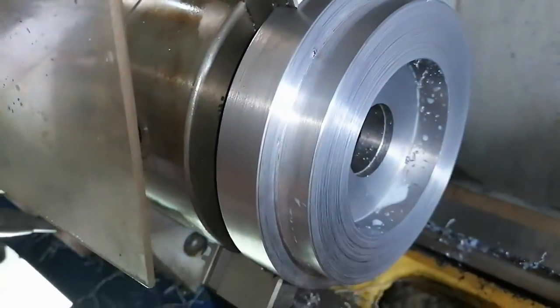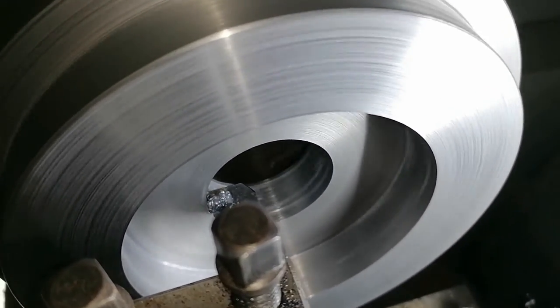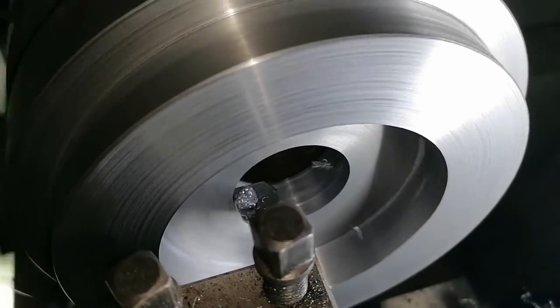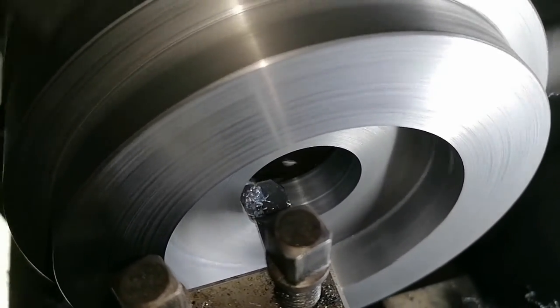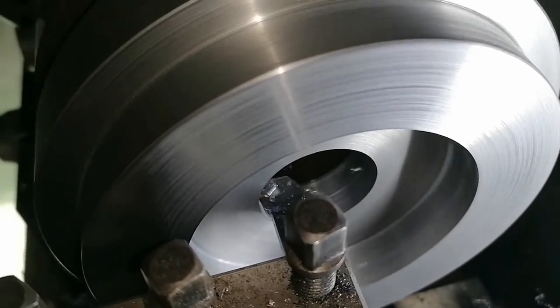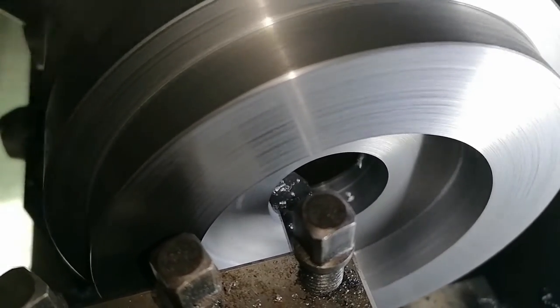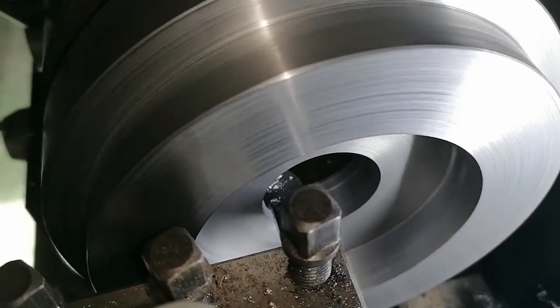I think that should be fine. I'm just busy with the bore now. This one must open up to about 40 millimeters. The shaft is 40, so this must be a tad over — 40.05 or something like that. Nice — force it in to be a nice snug fit, and then it will have to be welded.